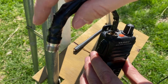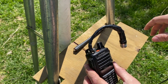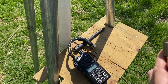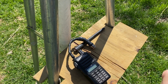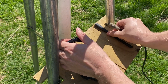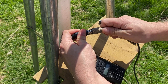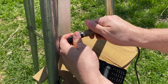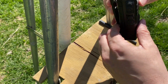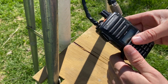So we'll thread it in here gently, I don't want to strip my threads. And then we'll take our PL-259 — that one's grubby too, I'll get some contact cleaner and clean it up a little bit. I always like to make sure the notches lock in so it doesn't rotate on the types that have that. And most do — always grip right here so we don't twist it worse. And then with this HT I always like to clip the coax in the back clip there just to keep stress off of everything, and that works pretty well.